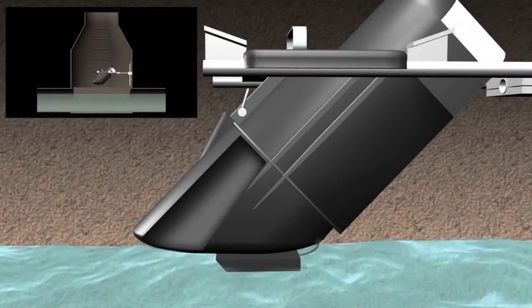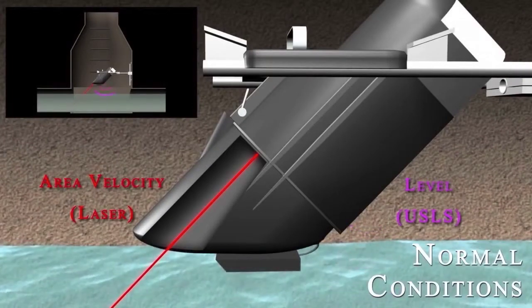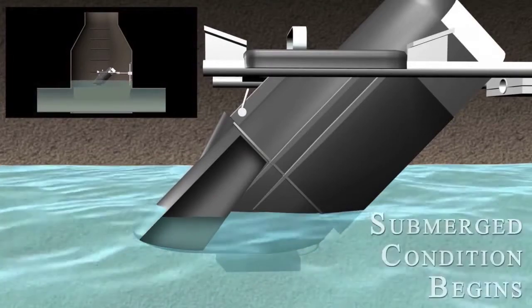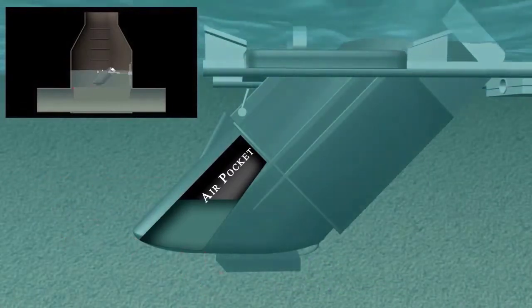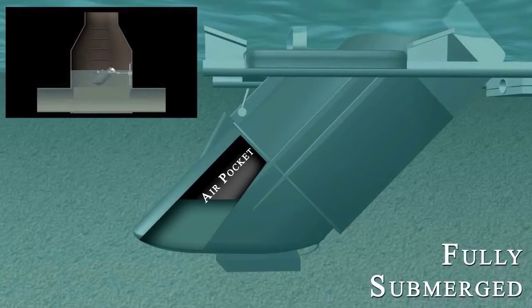Collection systems are often subject to surcharge conditions. With the surcharge option, the laser flow continues to operate. When water reaches the laser flow, a bottom-mounted continuous wave Doppler sensor and pressure transducer take over the flow rate measurement.